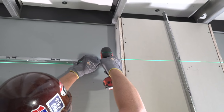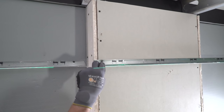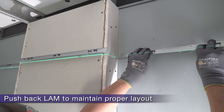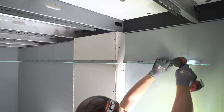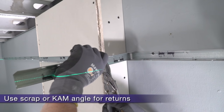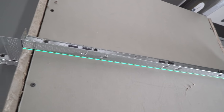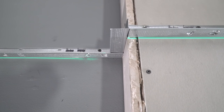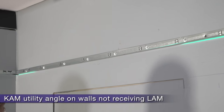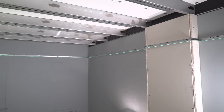On the 90 degree returns, just install scrap LAM or CAM utility angle. See how the LAM was cut and pushed back to the facing wall. With LAM, you need to make sure your screw attachments are to the studs 16 inches on center at the column. See how the LAM continues while maintaining locking tab spacing to the opposing wall's LAM molding. At the end of the column, push back the LAM while maintaining locking tab spacing. The locking tabs are only on the wall's face and not the returns, maintaining proper 8 inch on-center locking tab layout from wall to opposing wall.